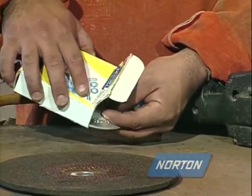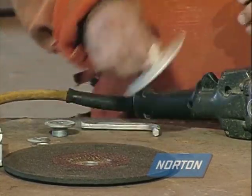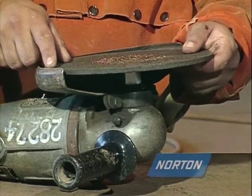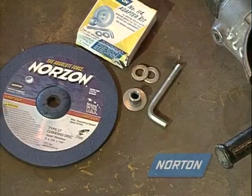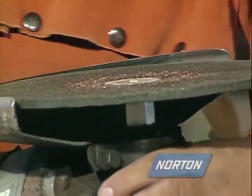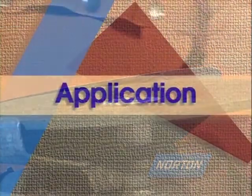When a discard mount is not already attached to the grinding wheel, a reusable kit mount can be used to mount a type 27 or type 28 wheel. The reusable kit mount comes with the back flange, bottom flange, and allen wrench for tightening the bottom flange. Washers are included in the kit that allow you to mount quarter-inch, eighth-inch, and three-eighth-inch thick wheels. This mount can be used many times before it needs to be replaced. A bent, worn out, or damaged mount should be discarded.